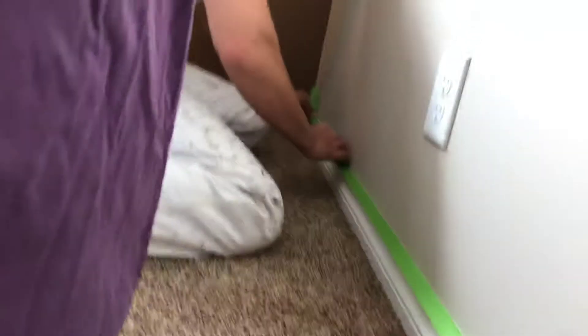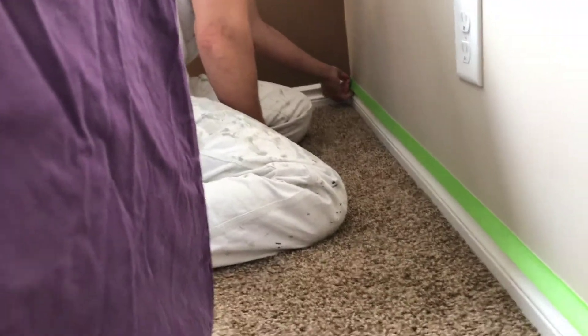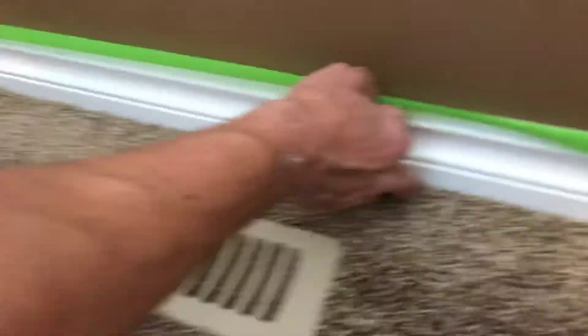This is just doing everything normally. When I'm in a brand new house I would have all the trim sprayed. Coming down to the next couple of last walls here — pull some tape, keep tension on your tape, place it, and just keep tacking it down.